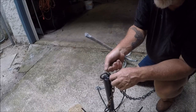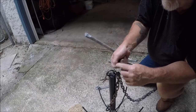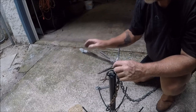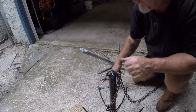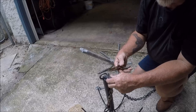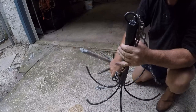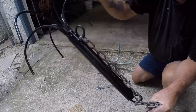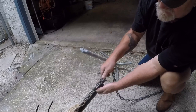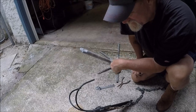A lot of guys use zip ties, and they can do that if they're in a smaller boat. I just have too much windage, too much weight on the boat — I'm a 1,200-pound fishing team sometimes. So I do a whole bunch of haywire twists on this one that was up on the bow, bring the chain down and put it in this eye, then cut it off. Turn the sharp end around so it doesn't get me. So the chain and the anchor are like that — when this gets really hung up, which even these do, because 90% of the time it's the chain, hopefully you can yank on it and it'll bust it and bring it out from the top.